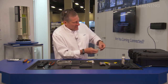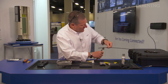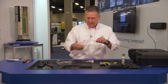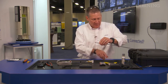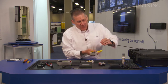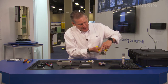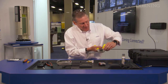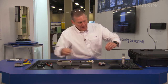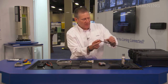You want to get your 900 micron fiber out and get it out of the way, then go and get your side cutters and cut at 75. This gets your fiber prepped out, and this is the part you're going to use to install the connector. Next, we're going to use a sheath removal tool manufactured by Ripley to help you get this outer jacket off of your GRPs and your 900 micron. There is a stud here at the end and an arrow — your cable wants to come in here, and at the end of the stud is where you want it to stop. Then you squeeze and pull, and you can remove the other piece of jacket, leaving your 900 micron fiber and your two GRPs for strain relief.